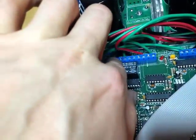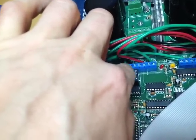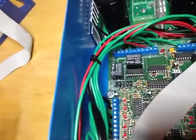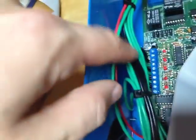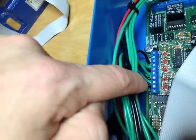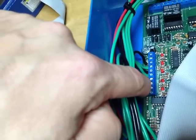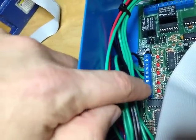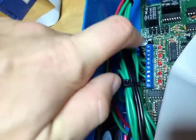Here's the other 5 volt input — this is used to actually power the output. All I know is it does not work if you don't have 5 volts plugged in here. It has some extra jacks to daisy chain onto something else that requires 5 volt. The last ones over here are the relay inputs and outputs — for controlling things like a vacuum system or coolant, wired normally open or normally closed. The inputs go: pin 15, 13, 12 ground pairs — one is for limits, three for homing, and the last is empty, reserved for e-stop, which I don't have set up yet.